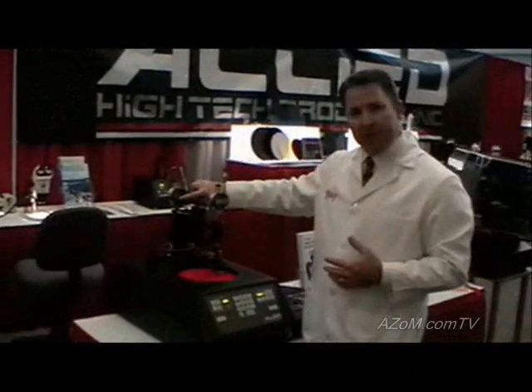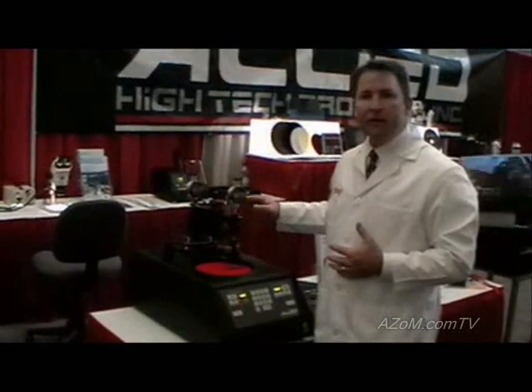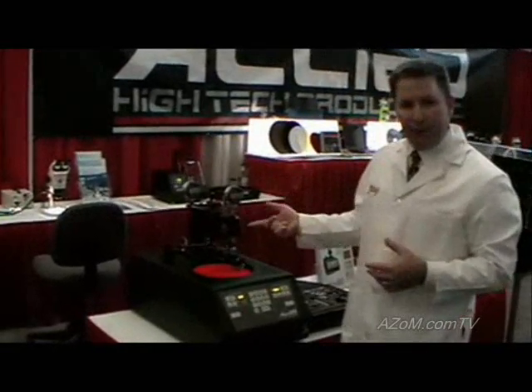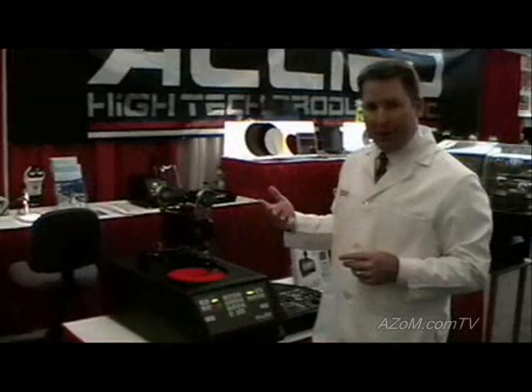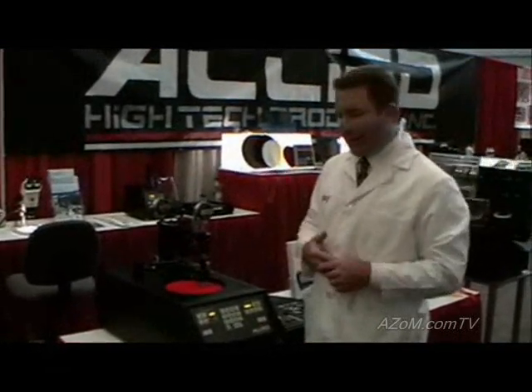The rear indicator helps you adjust the vertical position of the sample. For rough grinding you can remove 100 microns, 200 microns, or whatever that number is, and then eventually move to the front indicator where finer abrasives operate much more slowly in a more controlled operation. The front indicator also gives you an idea of how effective your abrasive is on the material.